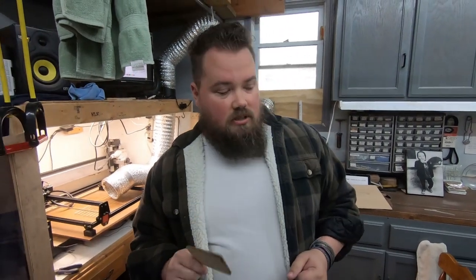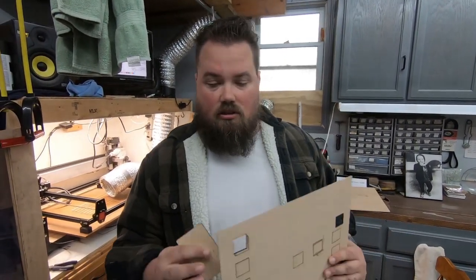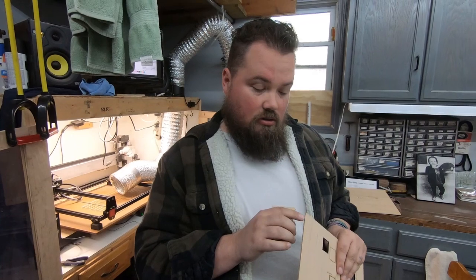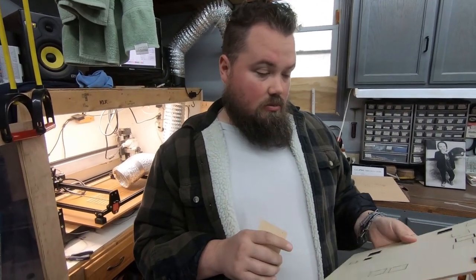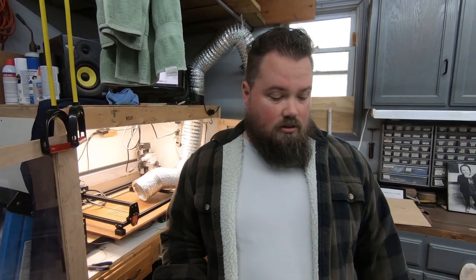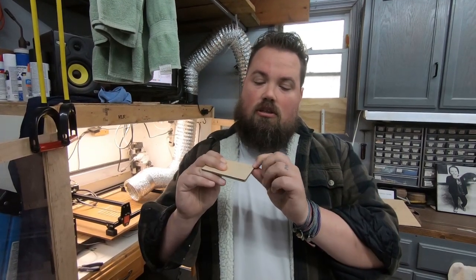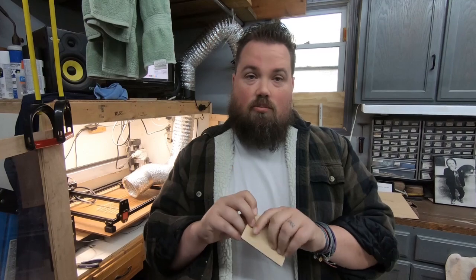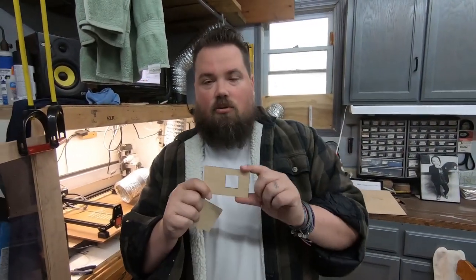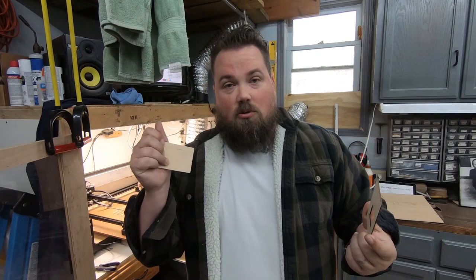Okay, so been testing again and looking at this wood a little closer — it's actually not plywood. It's some kind of pressed board or super thick card stock. It's what they use on the backing of cabinets. So I actually took two of these little 1.5mm cards that came with the laser, glued those together, and we're going to see how well it cuts that. I did it with one of them and it cut through in two passes perfectly, so hopefully four passes for two of them.